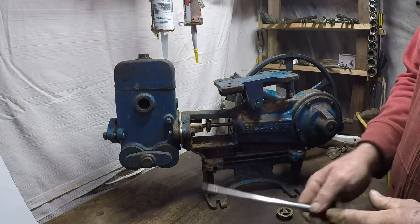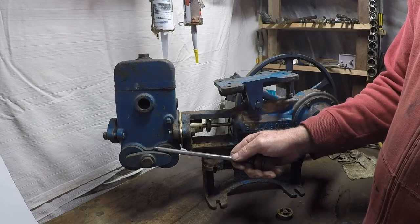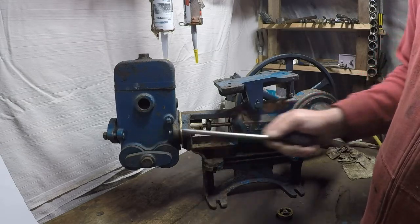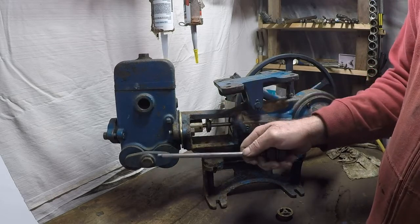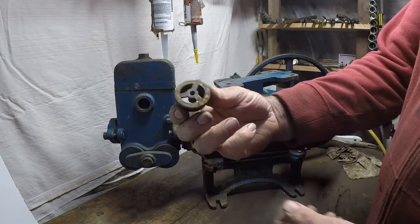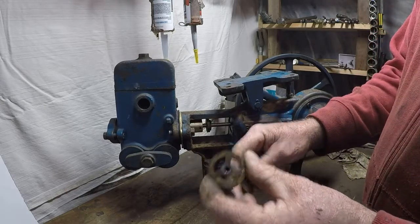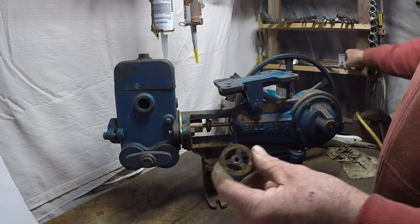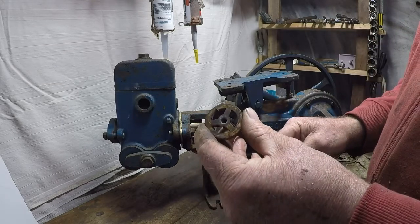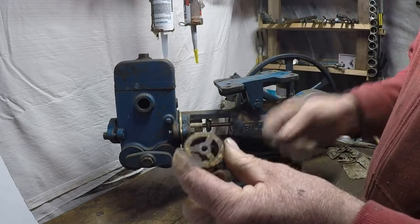So another thing is these bottom two valves over here, they're your suction valves. As the water comes in, these are the guys that hold the water when the piston pulls it forward and stops it going back through the pipe. Any stuff behind their seats, now this is what one of their seats will look like, and I've seen it where there was just a tiny little bit of stone poking through, and that was enough to cause the pump, no, it's just not going to work because the water's just sloshing back and forward past it.